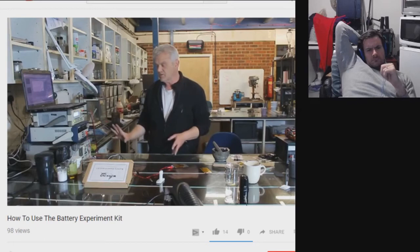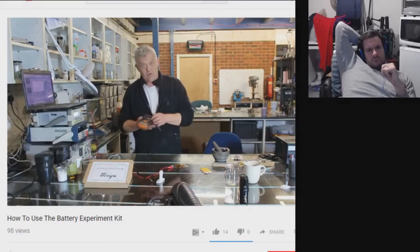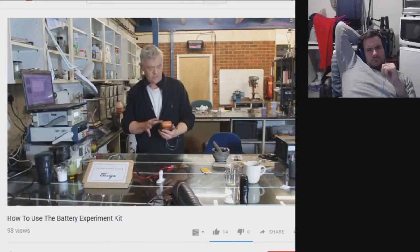If you break those down, what we mostly need to do is just record the information so that we can see how the device is actually performing when we make it. You don't need to spend that amount of money. There are plenty of things available. This is a rather cheap and simple digital multimeter, and I got it from the local electronics store. I think it cost me about £10. So it's really quite cheap. You'd need two, one for volts, one for amps. Remember, it's volts in parallel and amps in series when you connect it up. And you just turn it on and you can take readings from that.